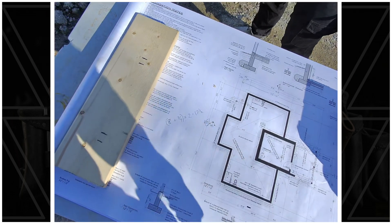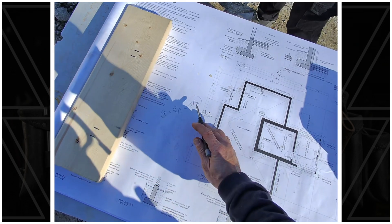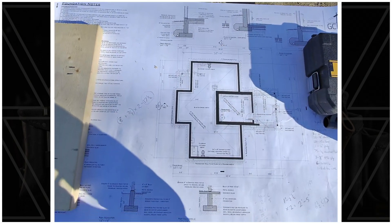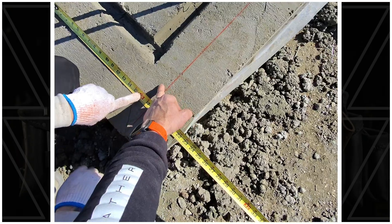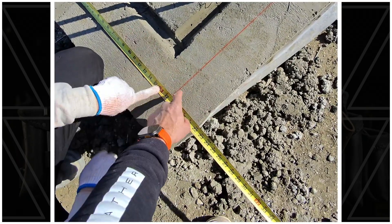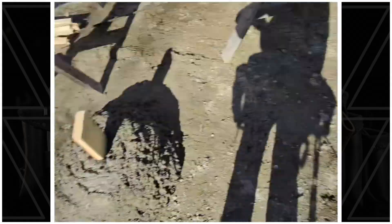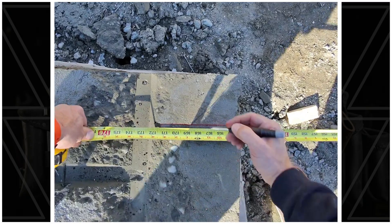Once I've got that figured out, I can use this 17 and a half inch distance as my reference for holding the tape over the line everywhere, and then go by outside dimensions and guarantee that my dimensions are perfect. This line here represents the plate, then there's 3 quarters of an inch of form ply and an 8 inch thick wall. So 8 inches plus 3 quarters times 2 is 17 and a half. We hold the tape at 17 and a half, and now I can mark my whole number out-to-out dimension on the plan — 14 feet.